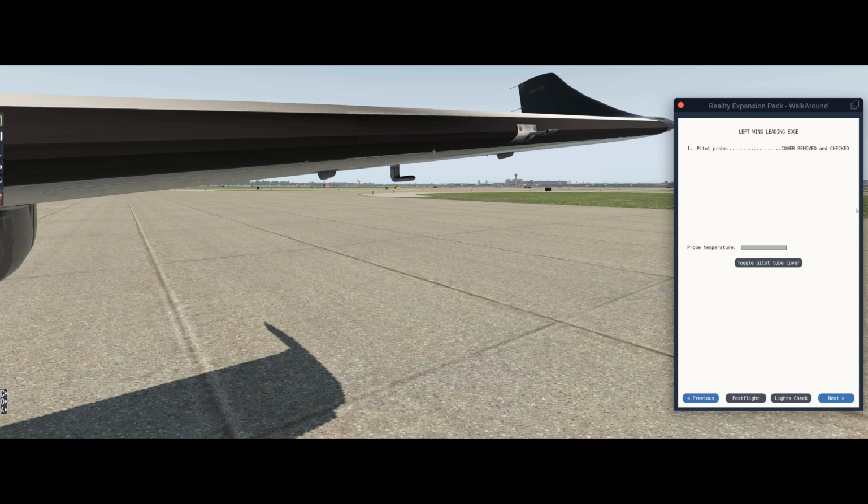Yeah, this is interesting. These probes aren't really right. So first of all, you do have an AOA vane here, and you've got one on each side. So you would want to check those on each side. This has a little tab on it that moves, and it should move very freely and easily. The test is if you could just set a penny on it, if it were deflected up, the weight of the penny should make it move down. So it has to be very nice and loose. And this little fin will just align with the relative wind, and it will show you your angle of attack. So we're checking to make sure that those are nice and free.